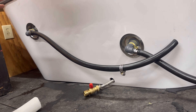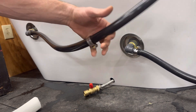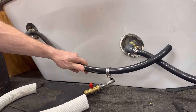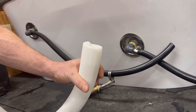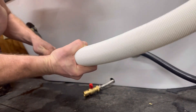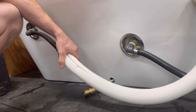Now we've got it all insulated on the inside like a Yeti cup. We're going to go to the outside of the tub — specifically for any type of exterior piping. We've got three-quarter inch rubber tubing from the Penguin Chiller cold tub kit. When your cold tub is sitting there, it's going to have cold water here, and this is definitely an area that benefits from insulation. I found some one-inch interior pipe insulation off Amazon — it's got a rigid outside. All you do is slide it in and wiggle it down, just make sure to get the right size for the inside of your pipe. You can slice it or unhook it and slide it down.